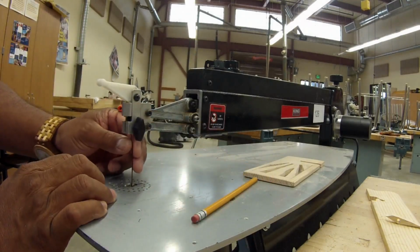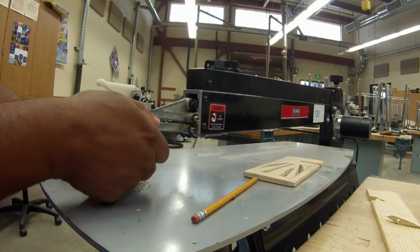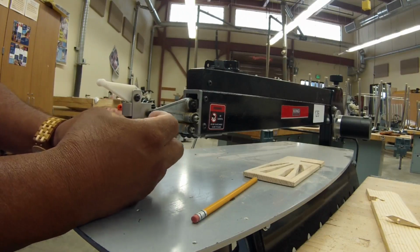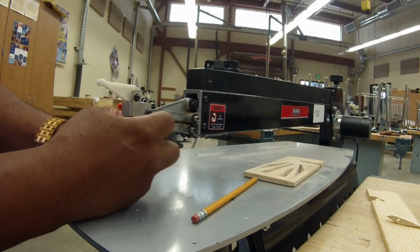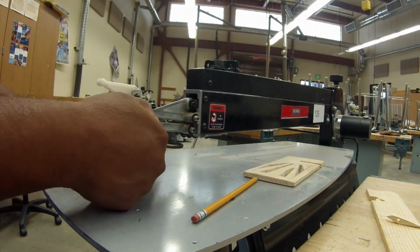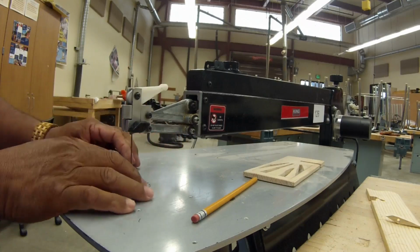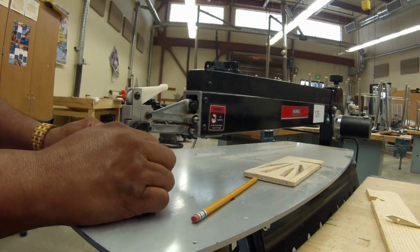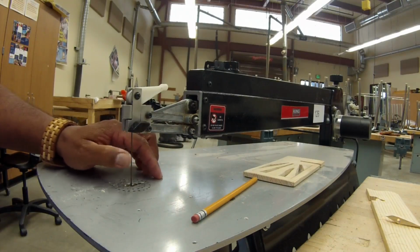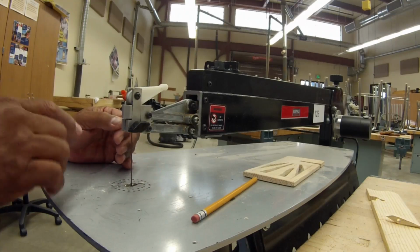One of the main things is trying to get this connected so that it's tight. You have to make sure that it's seated all the way back where the butterfly nut comes in and hits the blade. And sometimes it's harder than other times. So there you go. I've got a pretty good tension on there. That's about the sound that you should get when you're setting that.